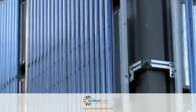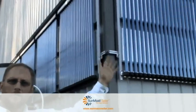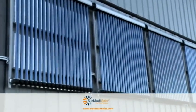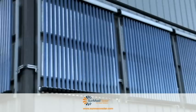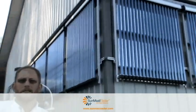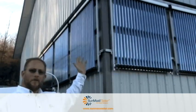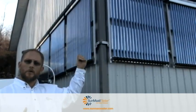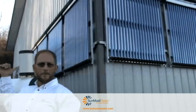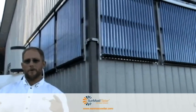What you see here are two banks. We have a southeast bank to my left and a southwest bank off to my right. One of the benefits of doing a system such as this is we don't have that south-facing facade. We have an east bank pump with a separate return bringing the fluid back up to the collectors, and a southwest pump that brings the fluid up independently. So we have two separate pumps.